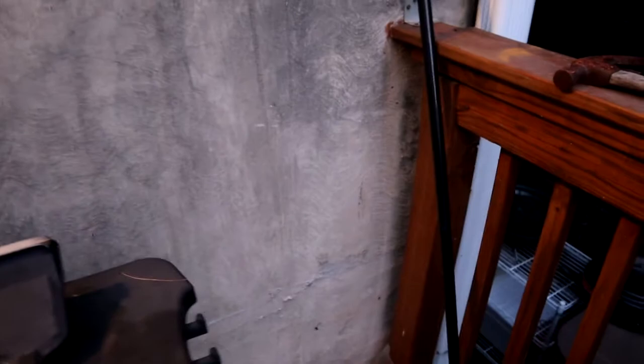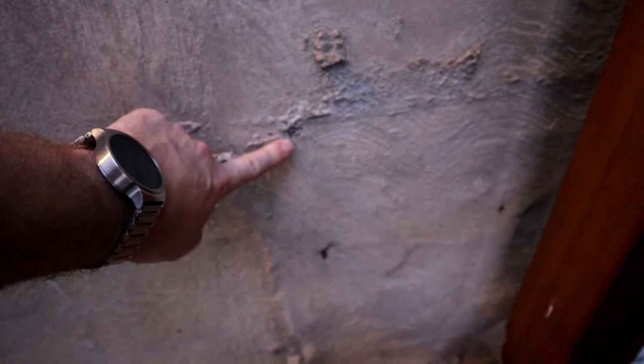All right, so it's getting late but gotta get to work anyway. Back here I'll show you — I moved my grill and moved that fridge out of the way. Back here is where my wife wants that hose bib to come out of the ground. It is 18 inches off the deck. The first thing I need to do is find out exactly where that spot is behind my fridge, so that I can know where I'm going. That is 68 inches from the edge of this door frame.